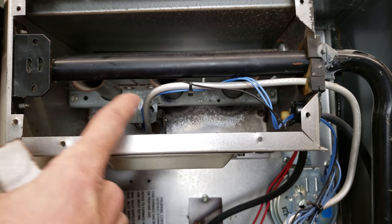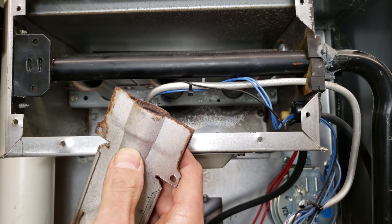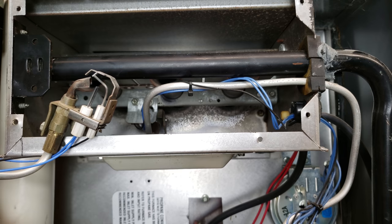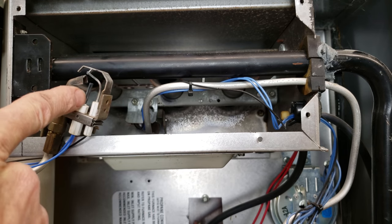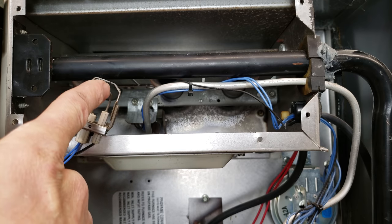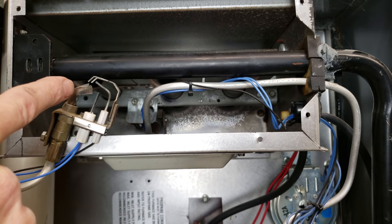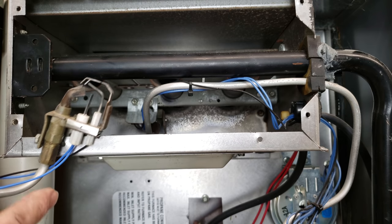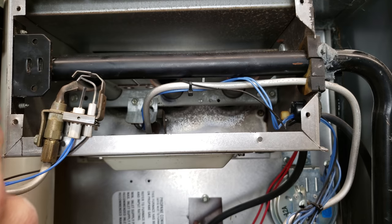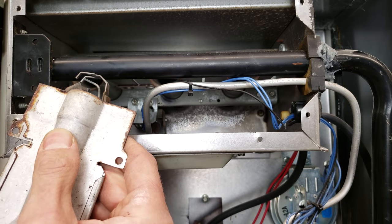Looking into the combustion chamber, you see three burner tubes. The burner tube head is where your orifice is, and right between two of the tubes is the pilot flame — this is the pilot termination head. You have your 24 volt hot surface igniter and your flame rod here. The flame rod is not touching anything; it has alternating current on it. When a flame is present between the pilot head and the rod, the alternating current gets rectified through the flame and direct current comes back on the pilot tube — the ground — back to the gas valve. That's your flame proving process. Once the flame is proved, the smart valve allows the main burners to turn on and allows full gas flow, which ignites the main burners.